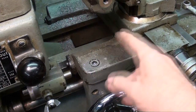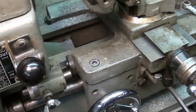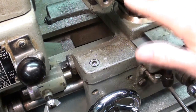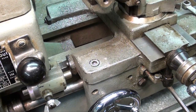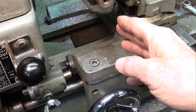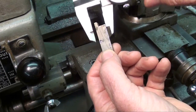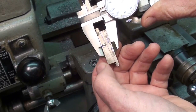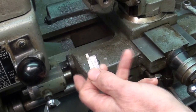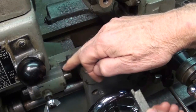I'm going to show you an alternate way of locating the carriage for the 468 thousandths. I'm showing you different ways because I know that some of you don't have certain tools. It's easy to make adjustments in the Y and Z directions because there are graduated collars, but there are no graduations on the carriage. Another way to do that is to use an adjustable parallel — I've set it for 468.